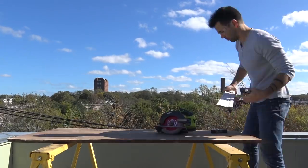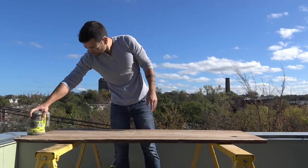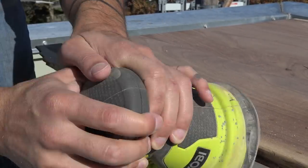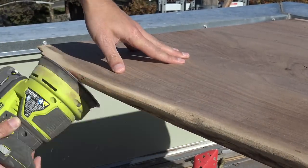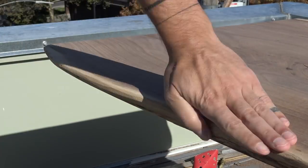I used my circular saw to trim the short edges of the tabletop. I started sanding the tabletop with my orbital sander and 120 grit sanding pads. After removing scratches and marks from the tabletop I then focused on rounding over the live edges. I did this by eye and just tried to provide nice smooth contours while leaving as much of the natural formation there as possible.